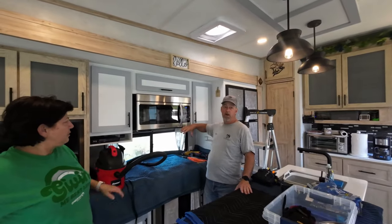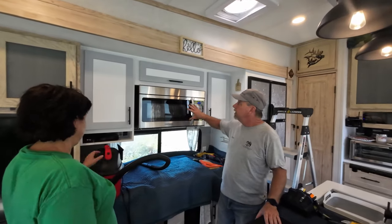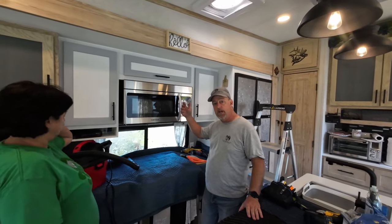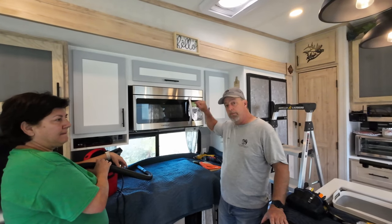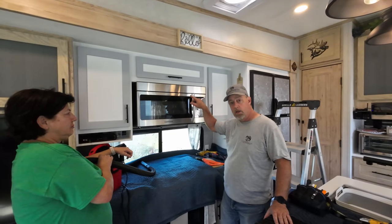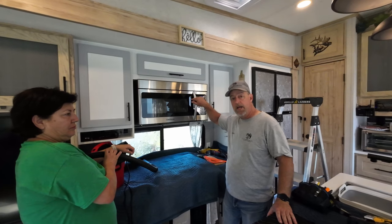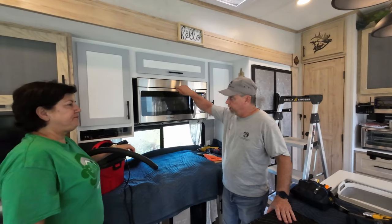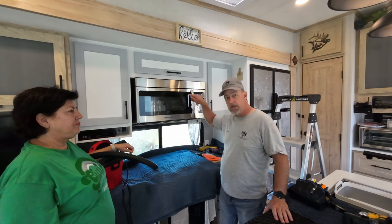Take down the microwave, the convection oven microwave conversion that I saw a wonderful video about. And we will spin the fan to change the vent from the front exhaust to a back exhaust. Then we'll mark and cut the wall. Before I fully cut the wall and punch through the outside, I'll make sure there's no stud in place. And then we'll poke holes to guide me outside. I'll go around outside, cut the fiberglass.